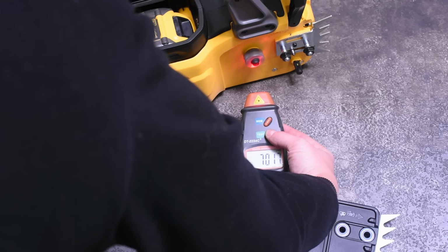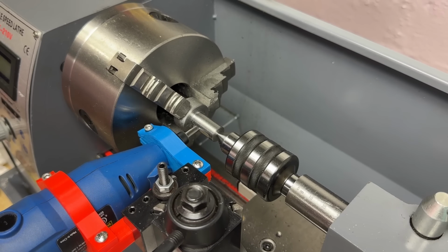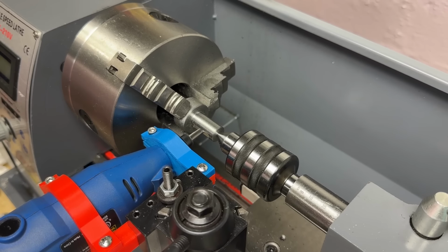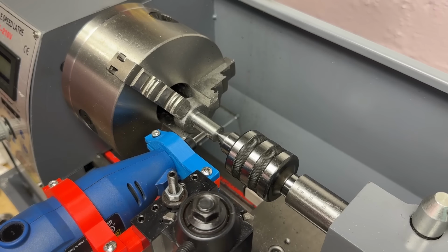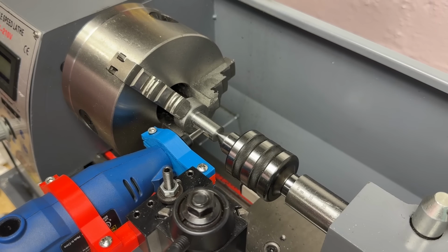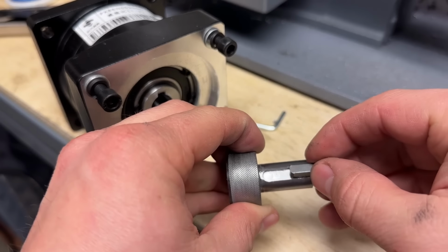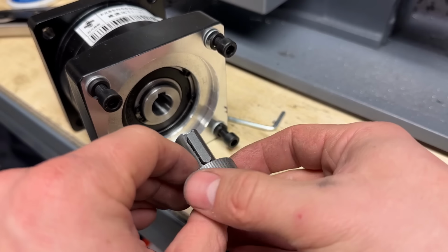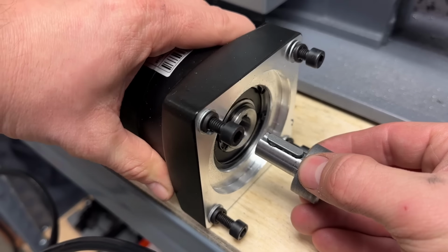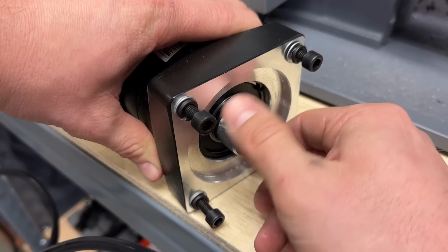So that's why we're using the old TTC lathe here and some custom 3D printed brackets by Logan from our TTC Skunkworks team to mill some parts. And this is to adapt the 60 volt DeWalt chainsaw to our own planetary gear reducer, a bigger, beefier one of our gear reduction choosing. This is because the 7,000 RPM plugged into the M18's gearbox would be a snail's pace with that type of gear reduction. Plenty of motor torque behind it, but no slap happy fun.